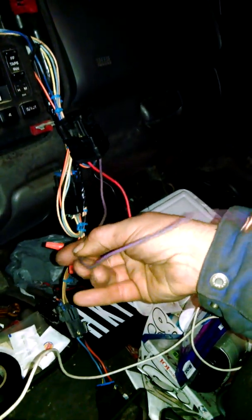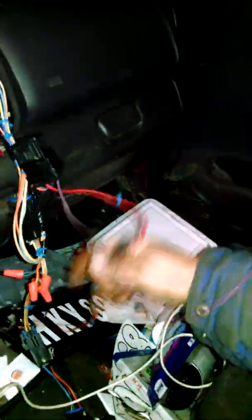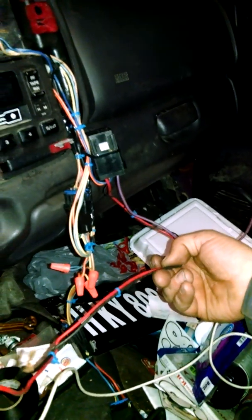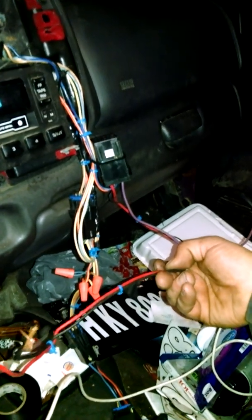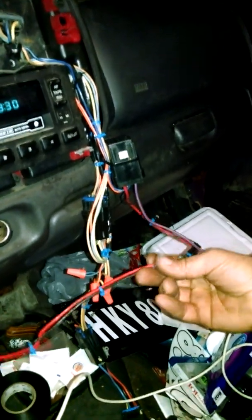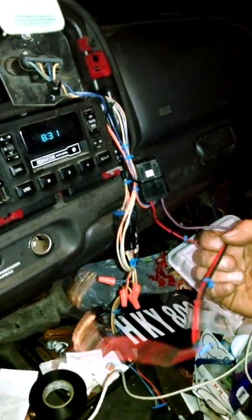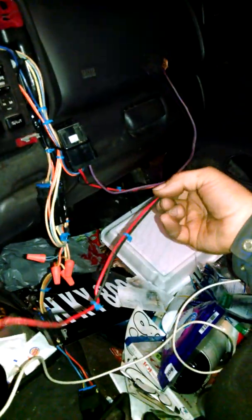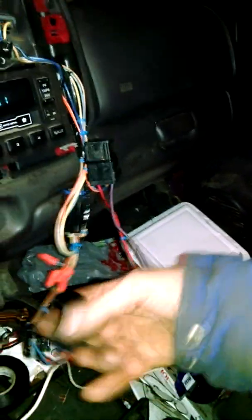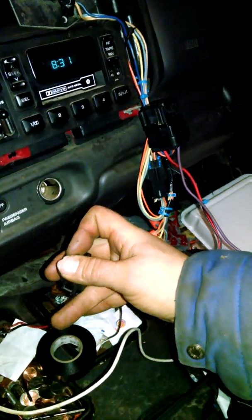This goes to a blower motor — these are your two main power leads, where all your grounds lead to and your main hot that runs to the battery. I'm going to jump a ground to the block and run it back in, so it has its own leads running into the car so it doesn't melt anything on the vehicle. There will be a fuse link — around 25 amp — that I want to put in here.